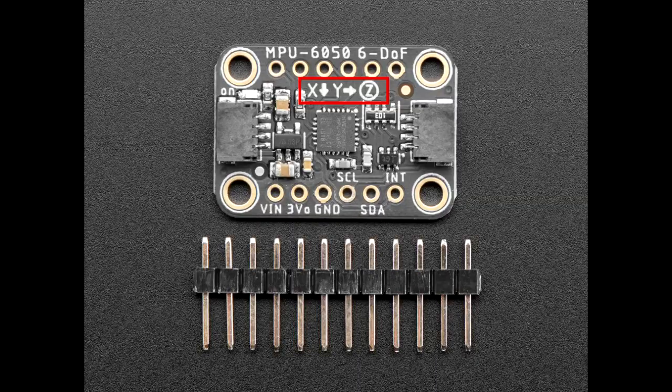If you look on the IMU chip, it'll have a little depiction of where those three axes are pointing, so you can figure out which one should be 9.81 and if it should be positive or negative. Once you've done this, you just have to write some code to estimate the angle of the robot given the IMU readings, and then use this angle estimate as the error term in a PID controller. There are a lot of good resources online for these two steps — I'll put some in the description.